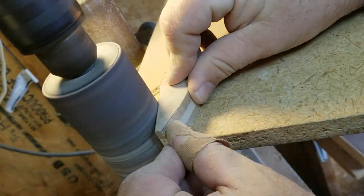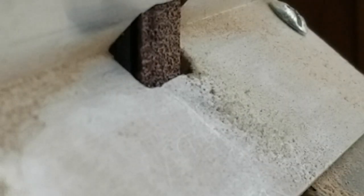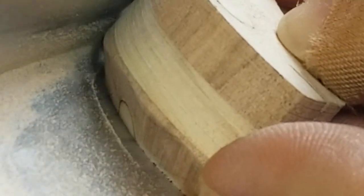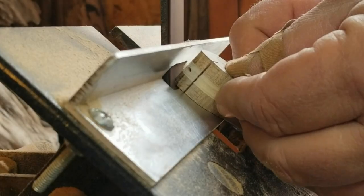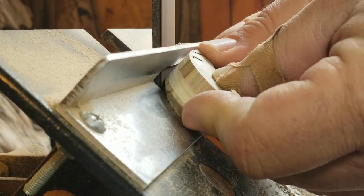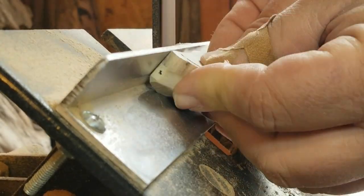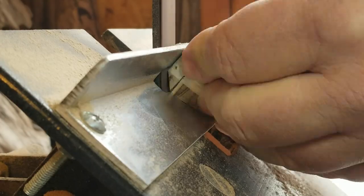I was a little hesitant to show this next piece of equipment, but I've discussed it with some fellow lure makers who have asked pointed questions about it, and I don't think it's quite cheating, but it's not rocket science either. Certain models, my main model exclusively, I can use this jig, and it really saves a lot of time. It's basically just a gate that lets me put a quarter inch chamfer around the lure. We can't, of course, do an inside radius, so I'm limited on what lures and which parts of lures I can use it on. But it's nice because it gives a consistent base chamfer to do the rest of the shaping from, a point of reference.